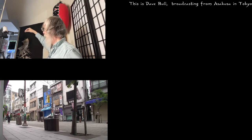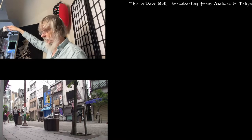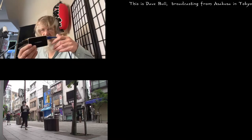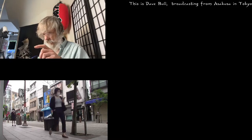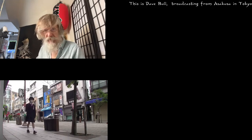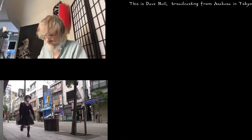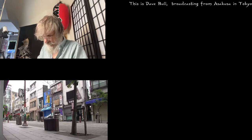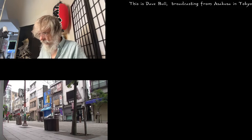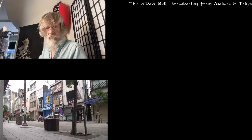So, what's the problem? The camera is showing me an image. It outputs HDMI. HDMI comes into the video adapter, and I'm not seeing the light. The light is not showing on the video adapter. It was a minute ago. I tested this all just when I set it up. So it's either the adapter that's wrong or it's the cable coming into it that's wrong. Wiggle it.